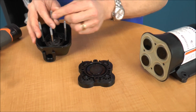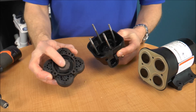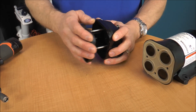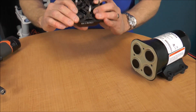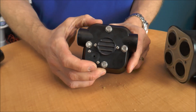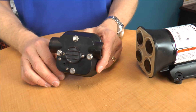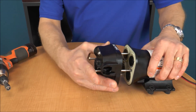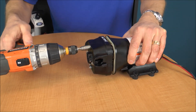So on the cover assembly, we'll make sure those poppets are down. The big valve goes towards the front of the head. Put it in — and this really isn't that difficult, I wouldn't be afraid of doing it. Now, during reassembly, there's a little arrow on the pump head — that's which way the water flows. At the factory, they reassemble them so that they're on the right-hand side if you're looking at the pump head. Slide that back in.